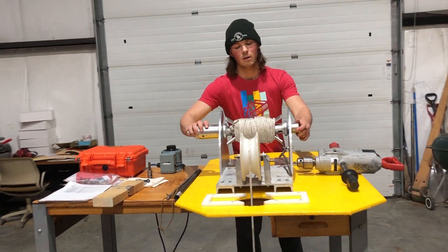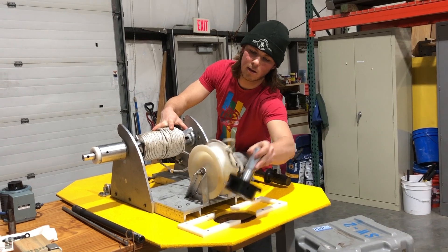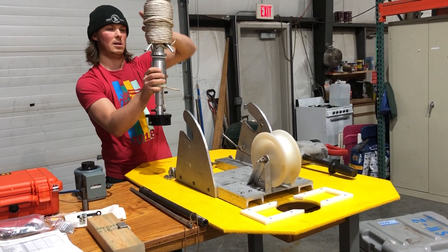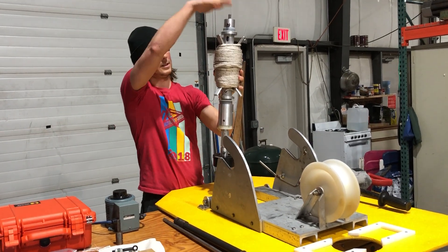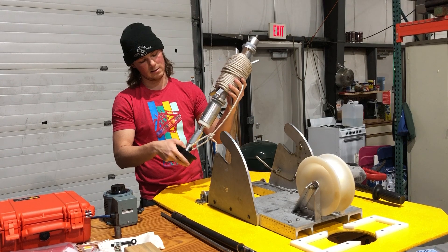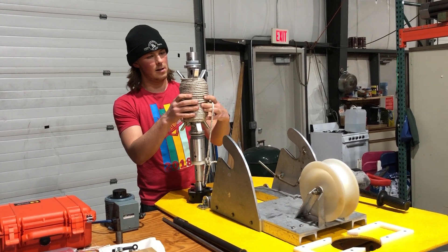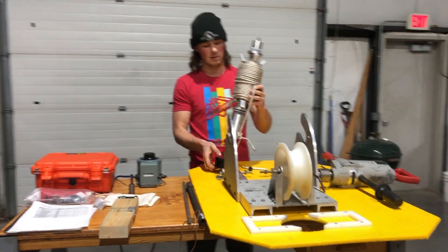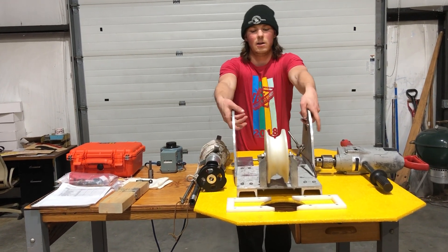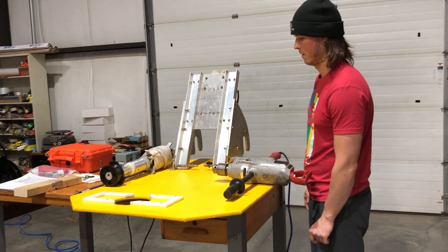When you're using the Sidewinder for coring, make sure all loose rope and clothing is secure — you don't want that to get stuck. Your core rails off the end here, your drill is attached at the end, and you can core by using the drill spinning it. This gets pinned using a standard IDDO extension pin from your hand auger kit. One critical thing for coring: this platform needs to hinge out of the way like so, and you'll have access to the hole here for coring operations.